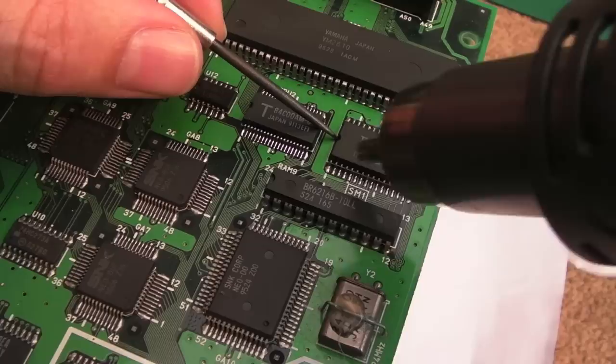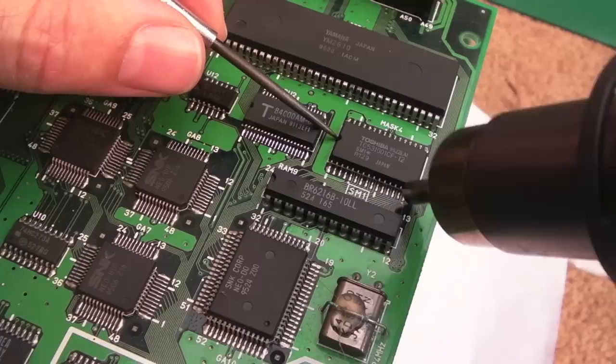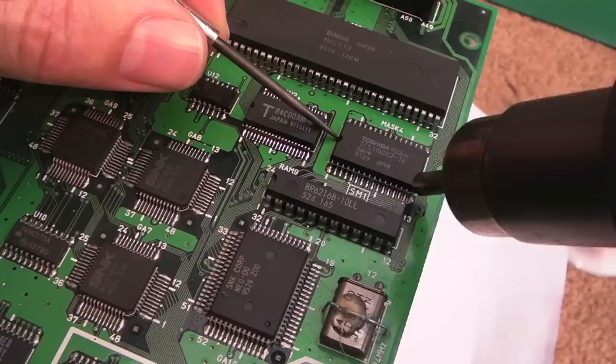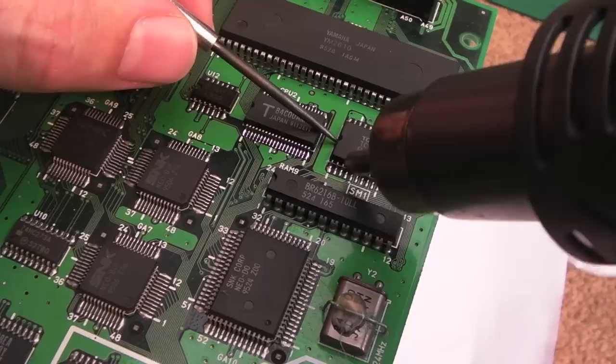The other interesting thing I'll point out is that I just tested it without the cart in there and it still did the same. I went to the Z80 test with no M1 test ROM, and you get exactly the same error. So it is like a chip select type thing where the Z80 cannot access the ROM at all. It can't even access the ROM on the cart.